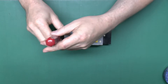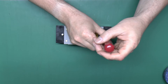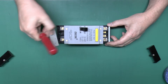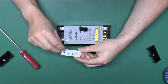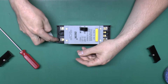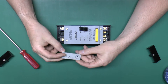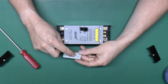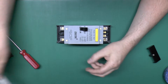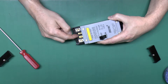These two covers at the bottom would be simply where the wiring was intended to be connected. This is a double pole switch, so we should find just the two terminals in and out. These little rubber gaskets are separate, and the intention was that you would put the cabling through those, which would fill any gaps so you wouldn't get fingers, dust, or whatever else going in there. Two large holes for the line and neutral wires to enter, and the two smaller ones would have been for the earth to the installation and the other earth going out to the electrode in the ground outside. Although of course you'd only connect the earth at one end of the device with those two smaller terminals.